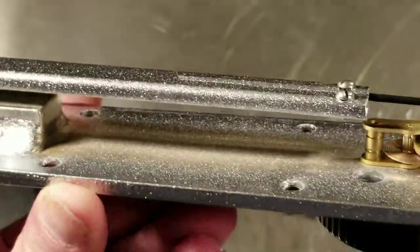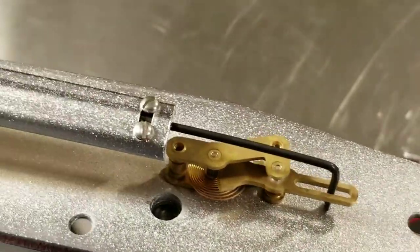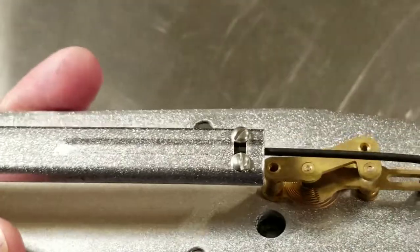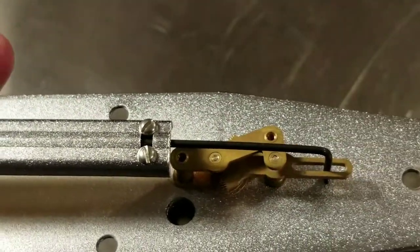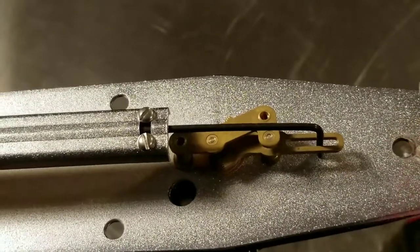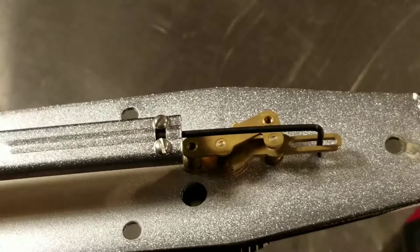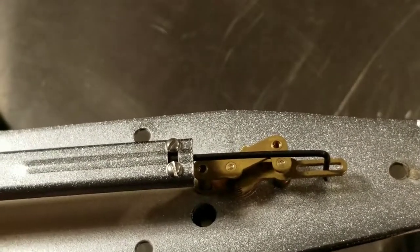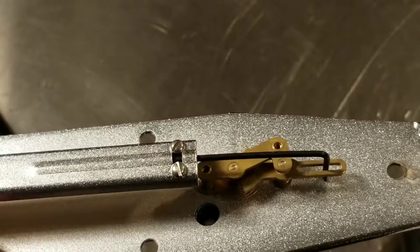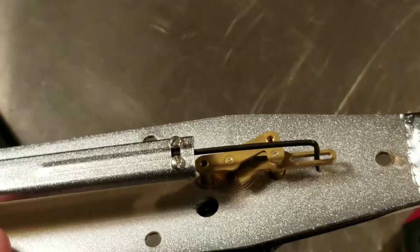Some of the plating got over to the other side — that's interesting. Here's your clock spring mechanism. This is how it's calibrated: there's a wire that comes out of the end of it with two screws and a clamp, and depending on how far in or out it is, it will deflect the gauge more or less. So you just set this up to where you have a known value using a digital torque wrench or a torque meter.